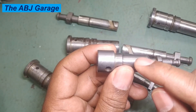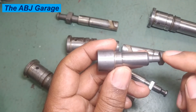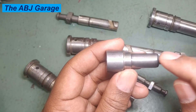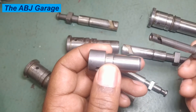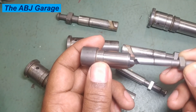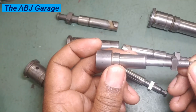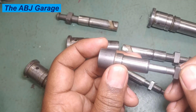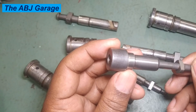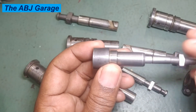The first thing you have to do before inspecting is cleaning. Remove the plunger and barrel assembly carefully from the injection pump, then clean both parts thoroughly. You should not be touching the surface and it must be free of dirt and debris. Clean both parts thoroughly using diesel fuel or a recommended solvent to remove dirt, carbon deposits, and any varnish from the barrel bore and from the plunger itself.